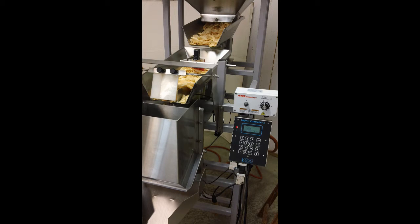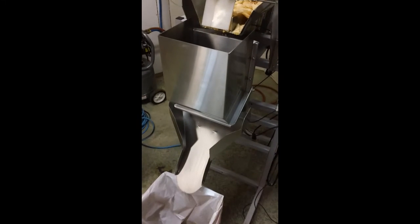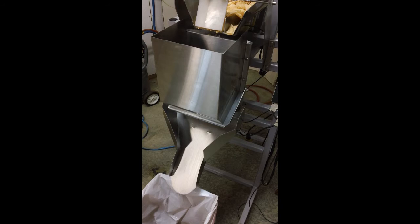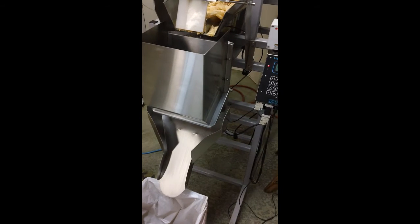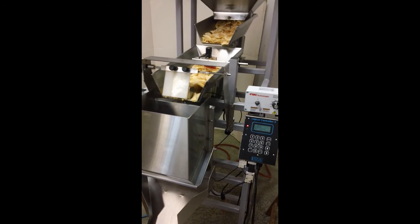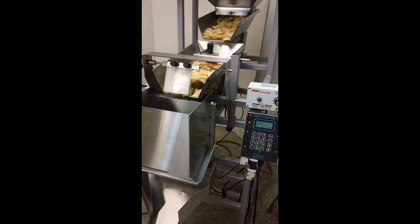This is a dual-stage machine with an upper and a lower feed pan. The upper feed pan is controlled by a control box and brush system, which is set at 5.5 to achieve the desired flow. Down below, there is a 5-inch discharge shoe. For the current bag size it's a bit of overkill, but it allows for the possibility of moving production up into larger bags as well.